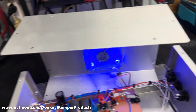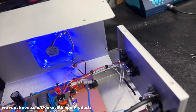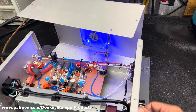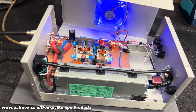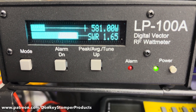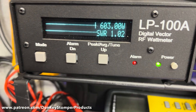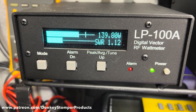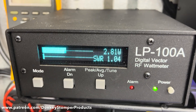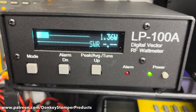In this case, this one probably wasn't bad to start with and then went haywire — it was actually the amplifier, a failed capacitor. It showed up on the dummy load so I found it there first. Just to ease 1207's mind, I put it on the antenna too. Average SWR is 1.05 on my joker antenna — no reflect at all. One-pill looks great, two-pill looks great as well.